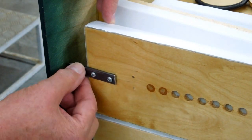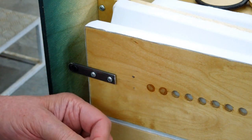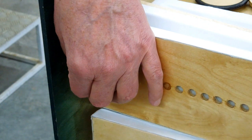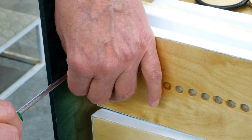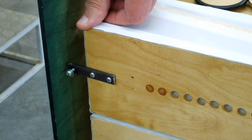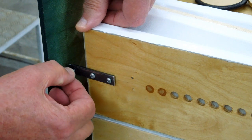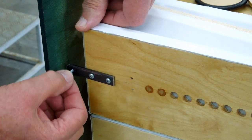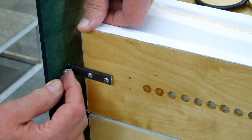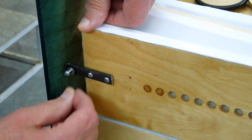On the end of this metal strap on the bottom of the bellows there's a rubber grommet. I'm going to take that screw with a washer and run that carefully through that grommet — I don't want to tear it up. Then that will go into the end of that wooden dowel. I'm going to put a washer on the other side of that grommet as well. I don't tighten this real tight, just snug. That allows some freedom of movement in that screw, and that's all that's needed for the end of that connecting rod.